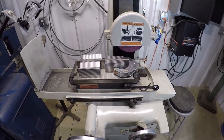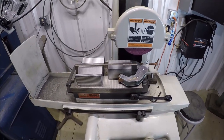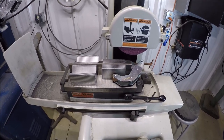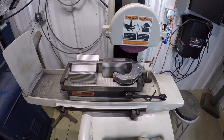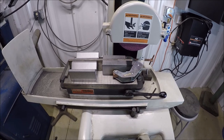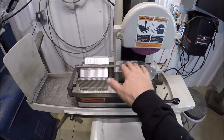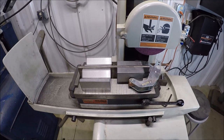Disclaimer: I'm not a grinder. We did not have a surface grinder in my college machine shop class, so everything I learned has been off YouTube, the internet, and of course I got pointers from Stan, DJ, and Steve Barton. I'm going to give it a whirl and see how we do. Also, I'm going to do it dry — we don't have that much surface area and by the time we get to our measurements I don't think we're going to get much heat into the part.